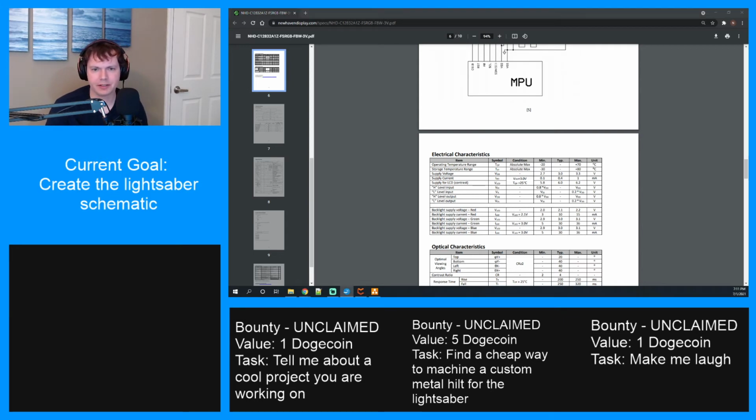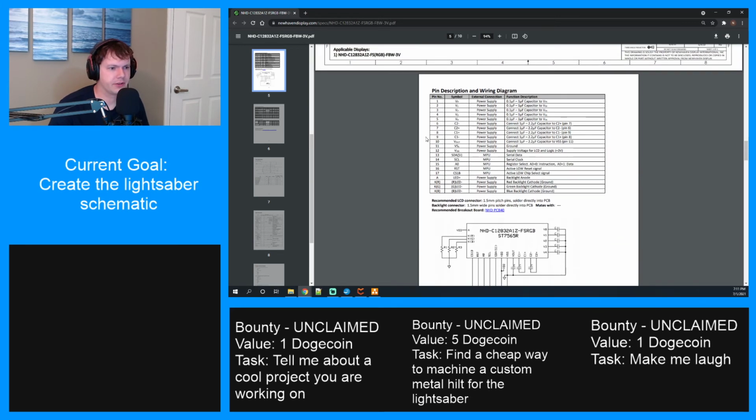Is there any LED-based resistors that I'm using already? 4.7 ohm, 1.5 megaohm, 154 kilohm, 1K or 10K. Yeah, nothing for LED type stuff. All right. Well, first things first, let's do all the other stuff. We have 1 microfarad. We'll probably use these 1 microfarads, not the 0.1s, if I have that. I do. Just because that'll make everything more stable. And I'm going to use them on these ones as well, so that we can just use the same cap all around.